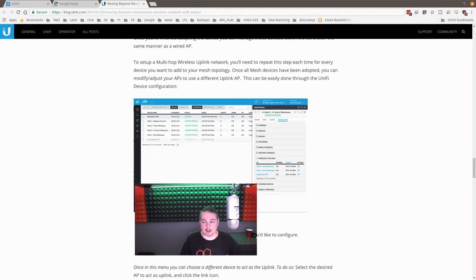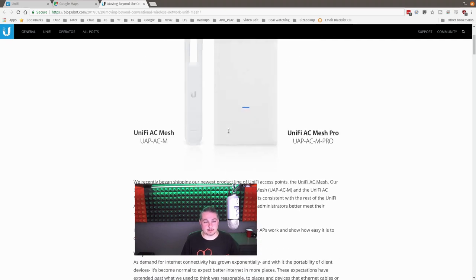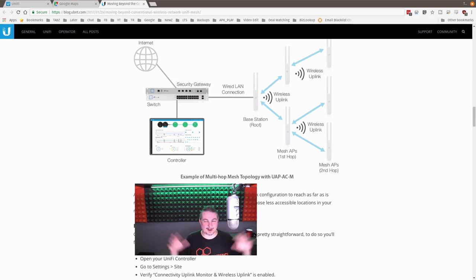I may do a specific review taking a closer look physically at these devices. The Mesh Pro also has dual gigabit Ethernet ports so you can do bridging and get even more speed. These are top-notch devices. We've done some installs and will be doing more — this equipment is solid, definitely highly recommended. And definitely fun meshing around in cars!